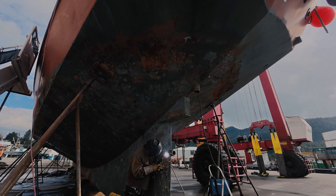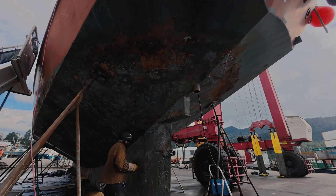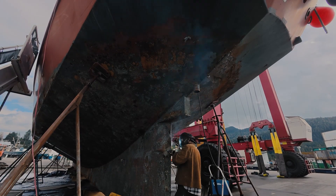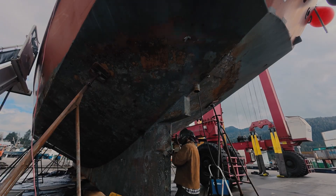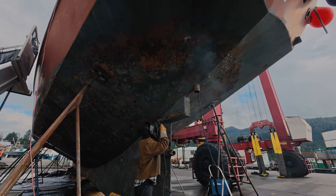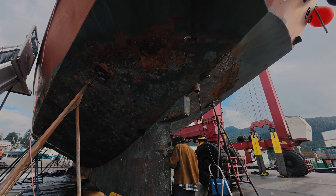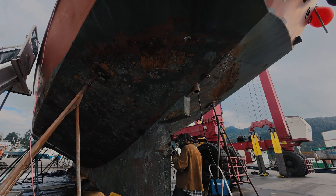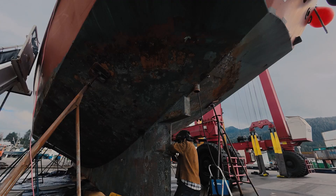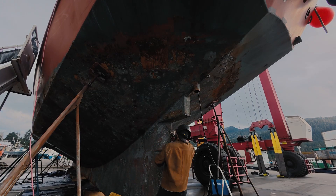Back for another couple of rounds — again eighth-inch 6011, just working on replacing the metal that had disappeared into the Ketchikan Harbor for the most part. Trying to stay focused on production without getting too hot, so it's kind of a constant balance of keeping moving but trying not to focus too much heat in any one area, because there's definitely some mystery as to what is behind all this.